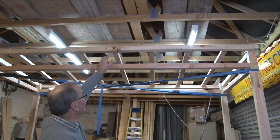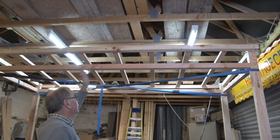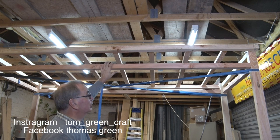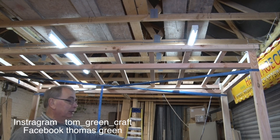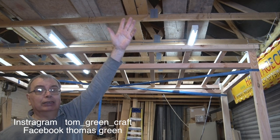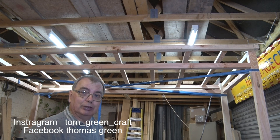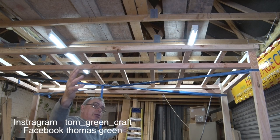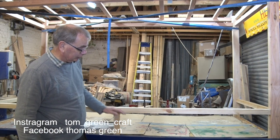Well, as you can see, I now have the roof structure in place. And what we've got is a 50 by 50 millimeter frame. And then there's some battens, 25 by 50 going that way. And it's all mortised together. This is much stronger than the old method. Then on the front of this, we have a flap that comes down 1 meter, and this becomes a roof which then extends out this way and then just lifts up out of the way. I'd like to pretend there's some fancy sophisticated method of doing it, but you'll be amazed when you see what it is. And there'll be another one on the back as well, and so we'll end up with a 3 meter wide roof. Then on this bit here, this is going to be our counter.